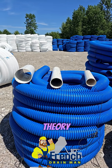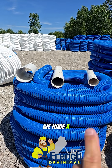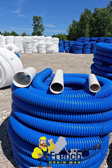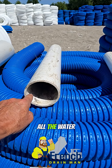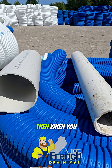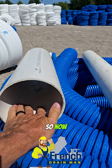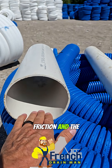Let's talk about the bigger is better theory. We have a six inch pipe, a four inch pipe, and a three inch pipe. I really don't know how much water I have, so I'm just gonna go with a really big pipe. But if you have the perfect amount of water for a four inch pipe, all the water in the center flows without friction. When you put that same amount of water in a six inch pipe, it's laying on more surface area, so the friction makes that water move very slowly.